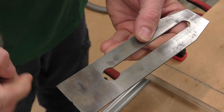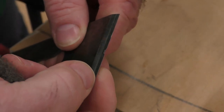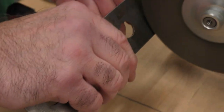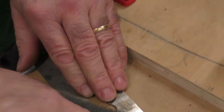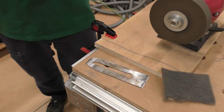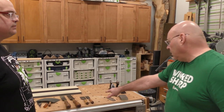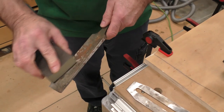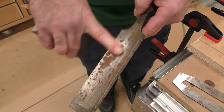We're going to take that and lap it. Look at this — you can see a couple of things with this bevel. You'll see that chip that's out of there, and you can see how it's semi-rounded. That's why we'll re-establish the bevel and grind it back eventually. But you see that schmutz right there? Watch that come right off — you'll see it comes right off as I do this. You can blend it — don't work the bevel. You can take it right down. It's a quick way. So what I'll do is maybe a Saturday or Sunday afternoon, line up all the stuff I need to descale. This is really good for a big gouge like this — I'll take that heavy oxidation off.